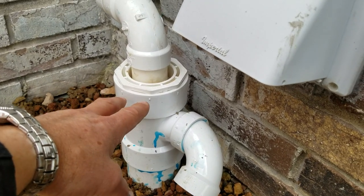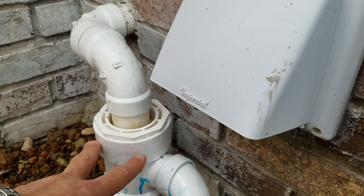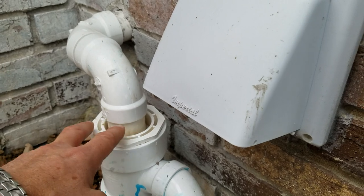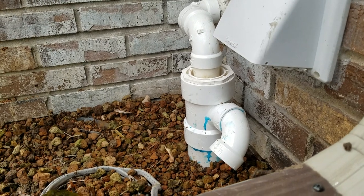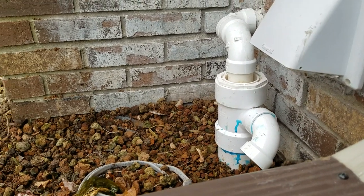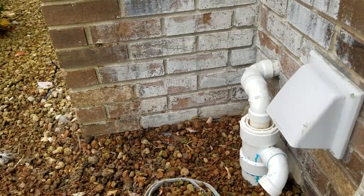The reason you want to do a connection like this: you have your solid, rigid pipe coming out of the house — you can't do anything with that — but this section is going to move up and down during the freeze and thaw, so that's why we build them this way. And here's your overflow protector: if that ditch ever backed up, the water wouldn't flood the basement — it would still find its way out here.